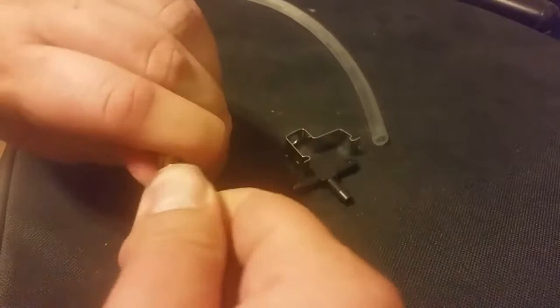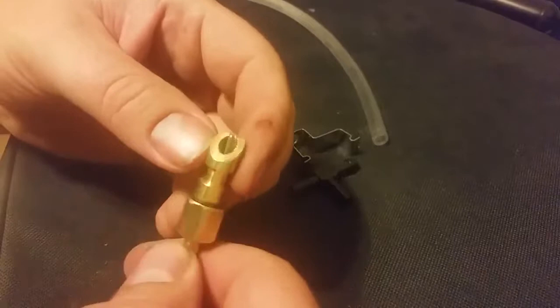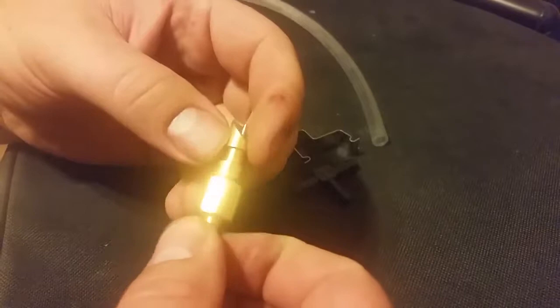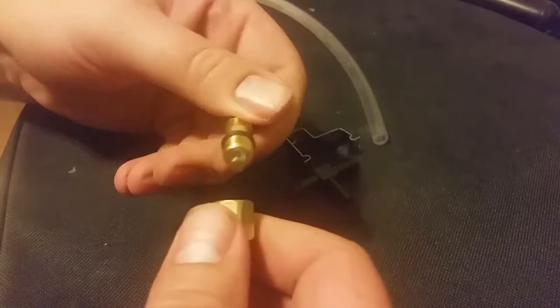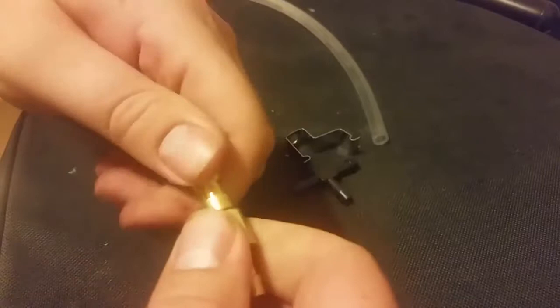You can see that it's fairly well constructed — it's not cast, it's actually turned brass. If these things get a calcium buildup from hard water, just disassemble them like I showed, soak them in some vinegar, then throw them back on the line. Get a couple extra ones so that you can do this on the fly and have some at the ready when you see one leaking.